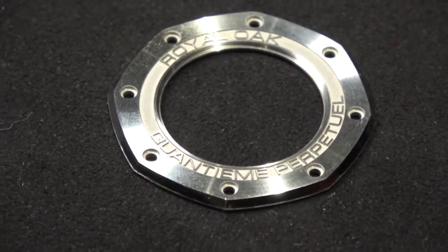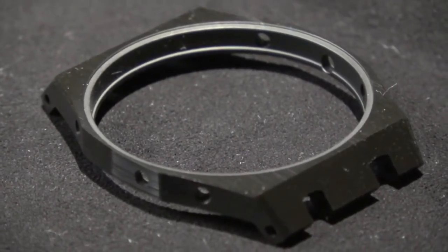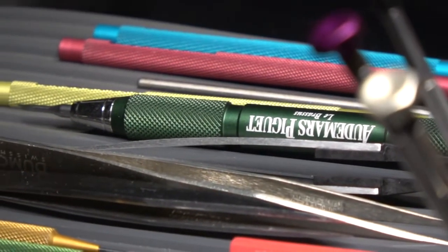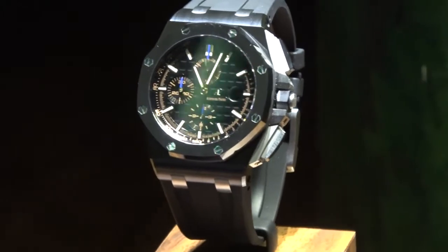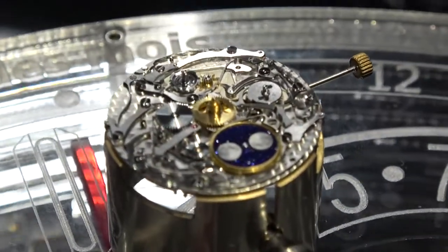When you have a watch back for a service, what kind of process does it go through? We disassemble the watch completely, as well as the case. On a mechanical watch it's just like a motor car — the motor needs oil. Cars we say when you drive you have to service it every year. The watch is more like five to seven years. We disassemble the watch case and movement completely, clean it at least two times to make sure all the old oil is gone, and then reassemble it with all the oilings and make sure everything is set up correctly. For a watch like this it requires quite more time because of the complexity of the movement.